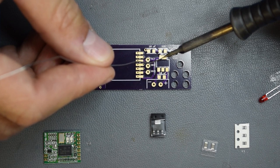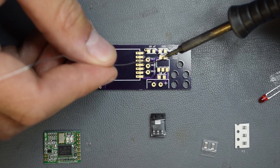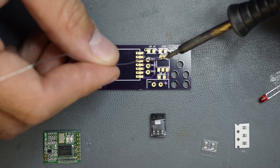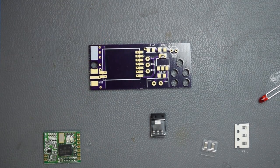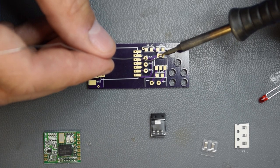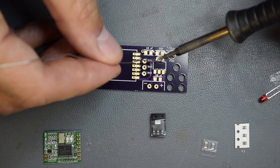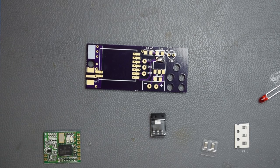It's supposed to be low melting point solder. It's melting on the iron a little bit now. Can I get it on the pad? So maybe starting to think about going on the pad. Alright, yeah, I'm going to go a little bit higher on that. Let's try 600. Alright. Normally I like to go at 700, but that seems to be working a lot better here. Okay, so now we have that little tin pad there.